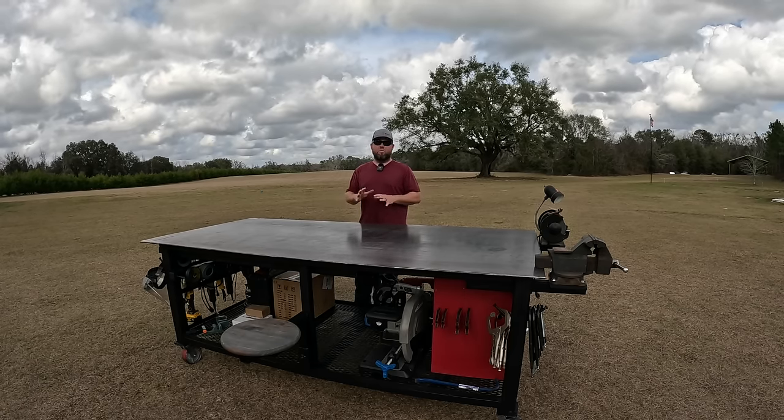But whenever I need all the working room on my table, or what if there's something else I want to bolt on a tube and use down here? Well, I've left it to where you can just take these tools completely out. You can put them right underneath. I got plenty of storage on my table, and now I can bolt a new piece of equipment in here or get a full working table back. And I will be adding some metal benders and other tools later on, so I'll just build a whole new plate, bolt the tool to that, and then I can just interchange all the tools that I want here. And the way I've set this up, I can also take my removable end down there, my extendable table, I could put it on this end if I want.